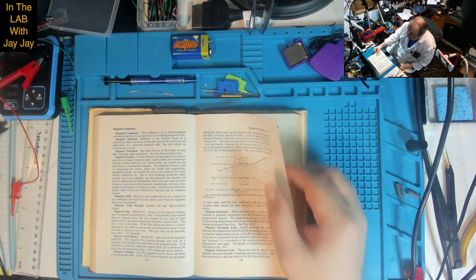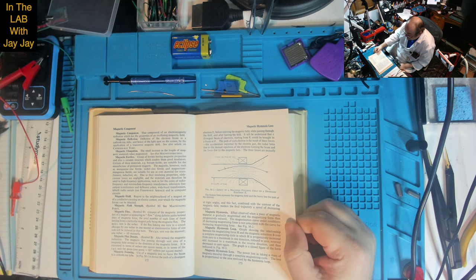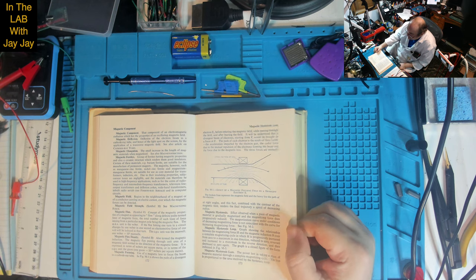Magnetic field strength, magnetic flux density, symbol B, also termed the magnetic induction. The magnetic flux passing through unit area of a magnetic field normal to the direction of the magnetic force. It is expressed in terms of Webers per square meter, or in terms of the CGS unit, the Gauss, where 1 Gauss is 10 to the minus 4 Webers per square meter. Magnetic focusing,